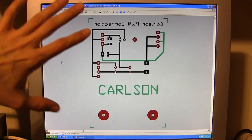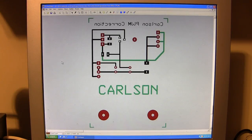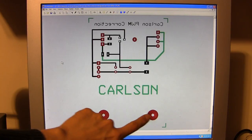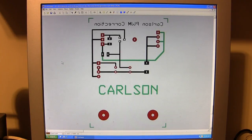I can make 20 of these boards in 7 minutes — I'll print out 10 on one row and 10 on another. I have a big vat and I put this thing in with a heated solution and it takes roughly 7 minutes — I have 20 boards etched off and ready to go. The drill time for a board like this would be about a minute. So you can see that there is quite a time advantage to doing this at your own home rather than exporting this to a PC board house. If you want to do a bunch of prototypes very fast, this works out very well and you get a very professional result.